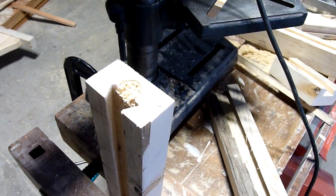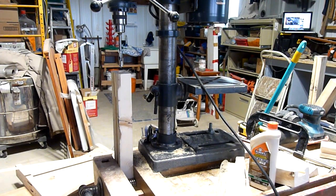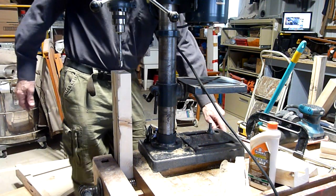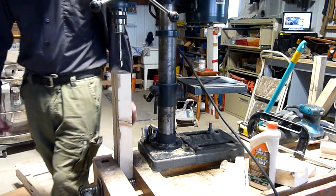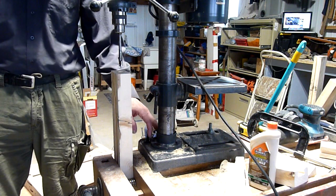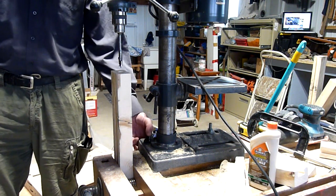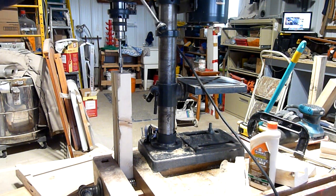So here goes, and then I'm going to do something Mickey Mouse with the drill press. All I can say is don't try this at home. I've got it bolted through the 2 holes here with this bolt. I've turned it around by loosening these, taking these 4 out and spinning it. I've got it clamped with a C-clamp here. I've got it lined up perfectly with the hole.